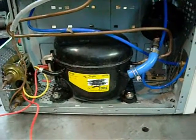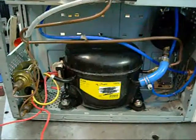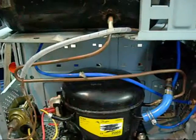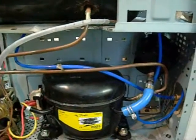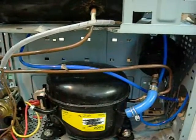I'm going to go for something much bigger with a high starting torque and a run capacitor. With a bit of luck that will start even at 175 PSI and continue to pump. This one here, you couldn't even get it to start at 100 PSI and continue up from there.